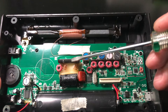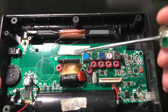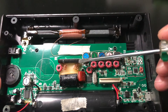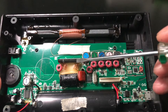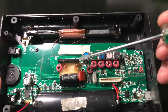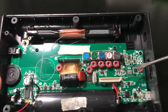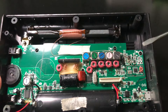We know the air band frequency is around 130 MHz, so this chip works on the air band frequency. The IF signal output from this chip does not go to the FM discriminator, because for the air band it's not FM mode — it's AM mode. The IF signal from this chip goes directly to the shortwave input signal pin on the DSP radio chip. Since shortwave works in AM mode, these two chips work together to demodulate the air band signal.